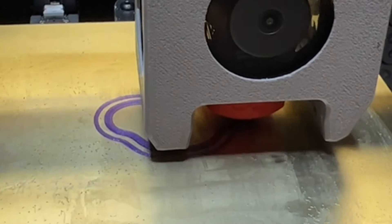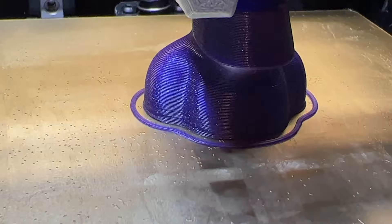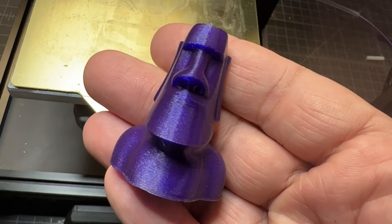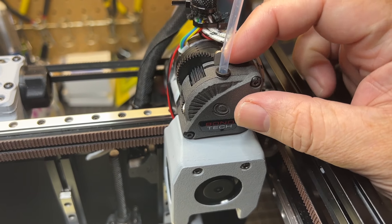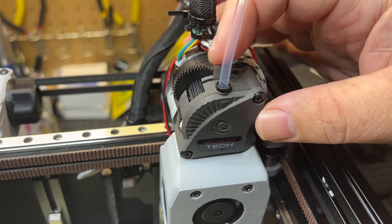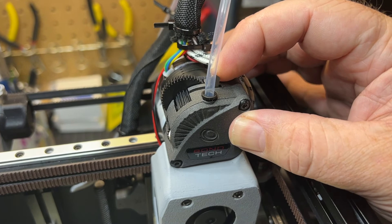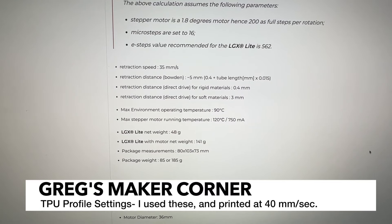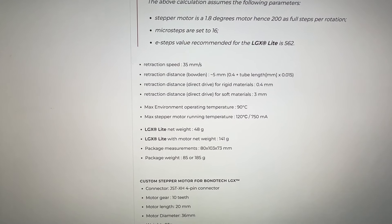I just used one of my PLA profiles and was pretty much off to the races. One thing I really noticed right off the bat is that the layers just looked extremely consistent. This is a 0.25mm layer height, so it is a little bit thicker, but you can really see that everything is looking pretty good overall. Here's the first print that came off — I think it looks really good. One thing you'll notice is there are three positions: the far left is open, the middle is for most filaments like PLA and ABS, and the far right is for TPU.